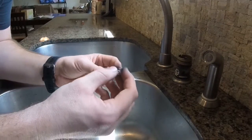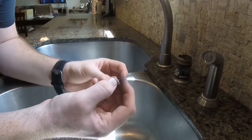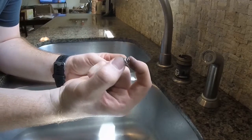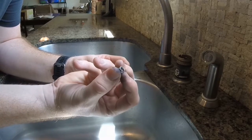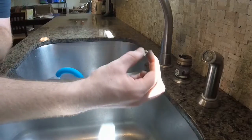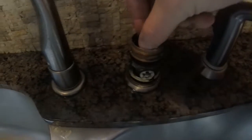Now that you've got that O-ring and spring-type seal removed, go to your kit and get the replacements. You've got a new rubber seal and a new spring. The spring has a taper to it — a larger diameter end and a smaller diameter end. The larger diameter goes into the faucet, so you want to put the small end into the seal first. Drop the spring in first, then place the seal on top, line it up with the hole, and it's good to go.